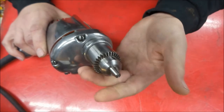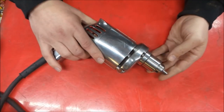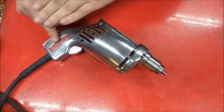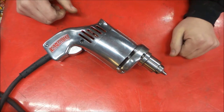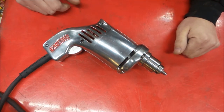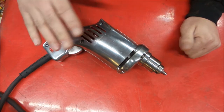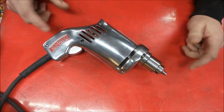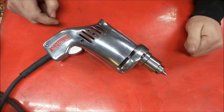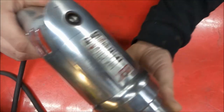I tore this all apart and put new jaws in it and everything else, cleaned it up good, put all new bearings in the entire drill, also varnished the inside of it, and cleaned everything up, the commutator, new brushes, gave it a good going over. I'm going to see if I have some of those photos, and I'll include them in the slideshow at the end of this video. But this is a Milwaukee 250